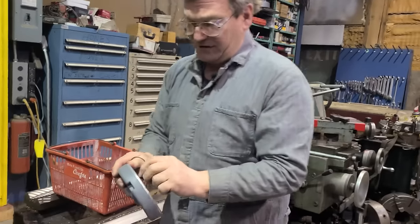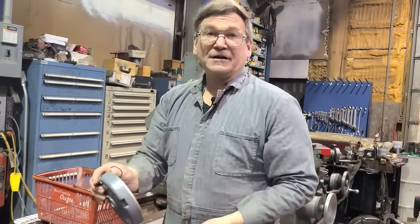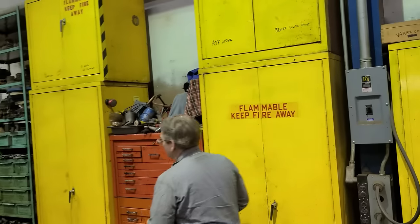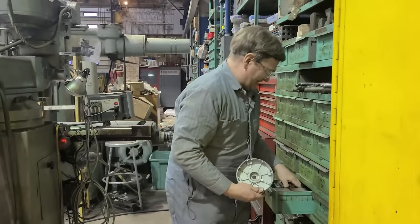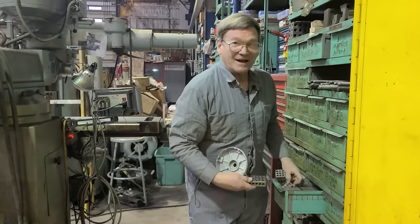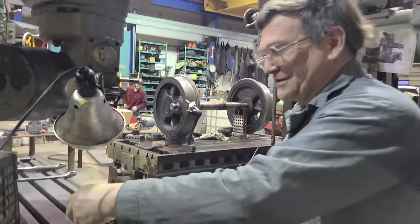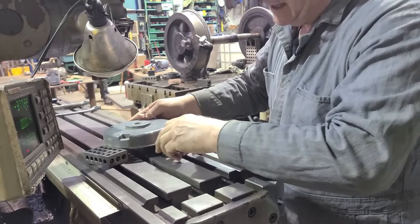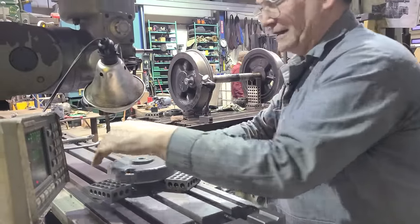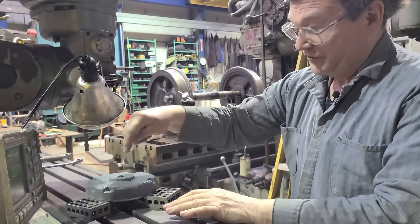I'm really pushing toward a milling machine for boring out the end bells. The advantage of the lathe is that we get to dial in on this surface here for flat - we can move it in the four-jaw and dial in on the center, all directly. If we're going back to the mill, a trick you do many times is grab your 1-2-3 blocks. Everybody should have lots of 1-2-3 blocks - some precision ones and some that are short of precision, piles of them because they're cheap today. You clamp only over the part that the block is sitting on, so you'd have three clamping areas.